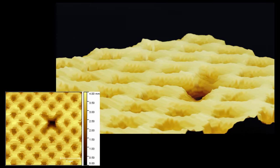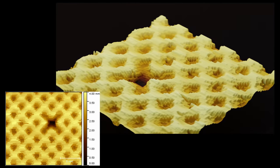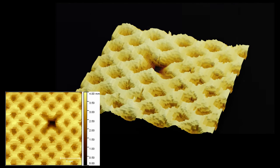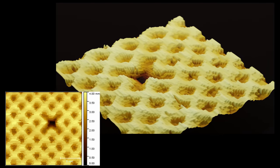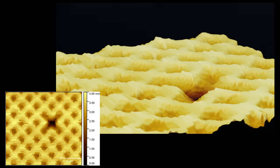There are different ways AFM manufacturers deal with the cantilever arc — by pre-angling the tip and having compensation control in the software. And while I built this macro AFM just as a demonstration, the scans actually come out pretty good. Here's a scan of that lattice — it basically looks like the lattice, there's the hole in the middle, all the features line up. The deepest part is about four millimeters and the individual crevices between the lattice is about two millimeters. It's a shockingly good system for as janky as it looks.